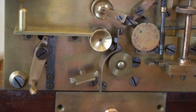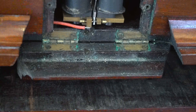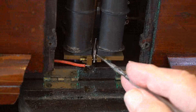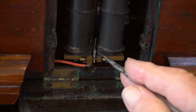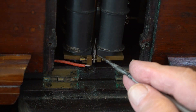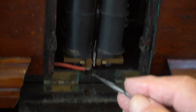The armature that moves the print wheel is very lightweight. I think it's designed on the same principle as a telegraph relay. It only moves a very short distance, as you will see. Down below, there are two contacts that the tongue of the armature operates between. On the right is the space, and on the left is the mark. When the current is off, it returns to the right, thus removing the print wheel from the paper slip. The contacts are there to activate a sounder, but I don't have one connected, so at the moment they just act as stops for the armature.